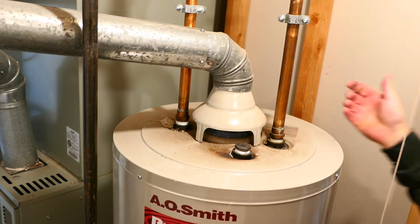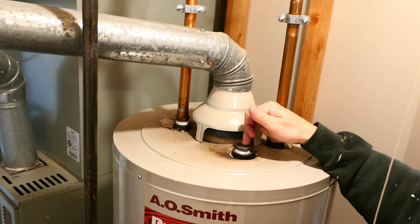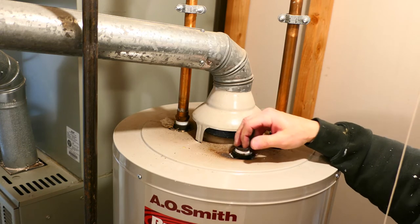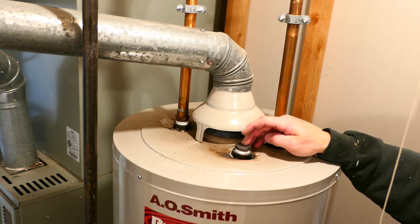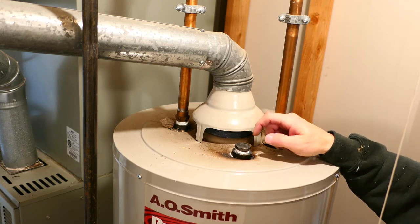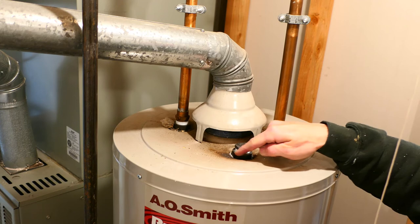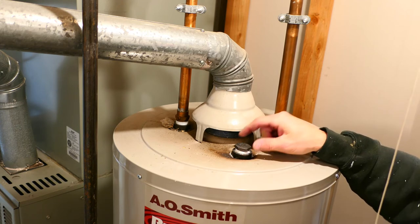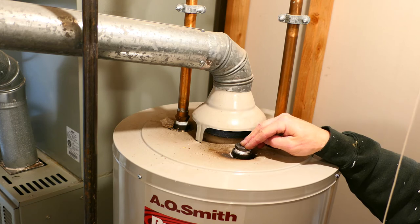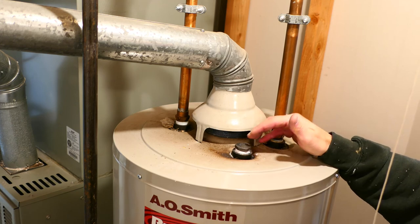That should be good. It's a good idea to mark on the tank the date that you changed the rod so the next person has some idea. Then we're just going to start the water heater back up — make sure the safety valve is closed, the bottom drain valve is closed, turn the water back on, get the tank filled up. This is a gas unit so I'll relight the pilot; if it's electric, just turn it back on. Listen and look for any leaks — you might hear an air leak if it wasn't tight enough, or see water seepage. Usually with Teflon tape it's plenty good. If you change this every five or six years, you should be in good shape.